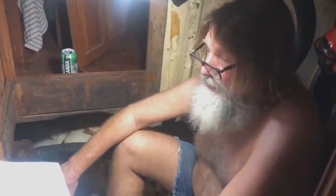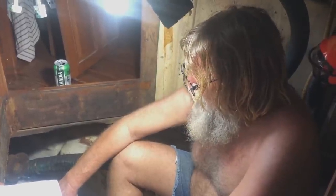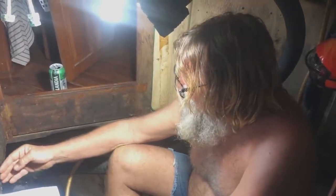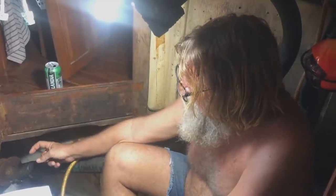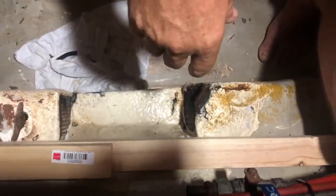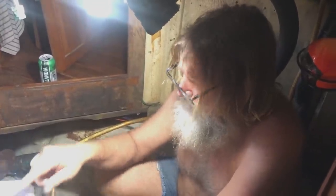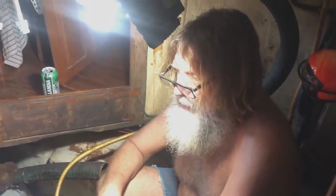So I want to try and make it as simple as I can, and if I position the engine where it wants to go, it's going to be really close to the back of this, so I'm going to have to bring it forward and put a little spacer in between on the end of the shaft. And I've also got this hole here that I don't really want to fill in, and the mounts are a lot closer together, only 446 apart on the new engine compared to nearly 800 on the old engine.